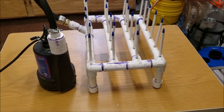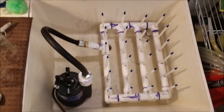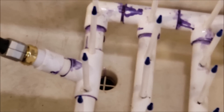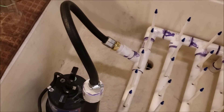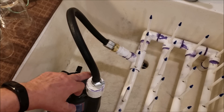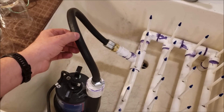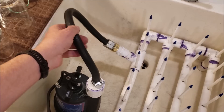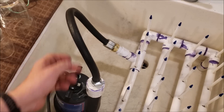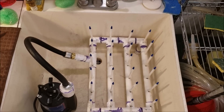Next step: testing and usage. There it is, and over on the side here is the pump. I cut a short length of hose with a one-and-a-half-inch to three-quarter-inch threaded barbed connector to a five-eighths-inch interior hose fitting. The hose wasn't very flexible so I heated it up with my heat gun and set it at a good angle, and now I'm getting ready to try it out.